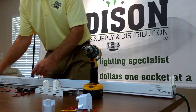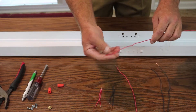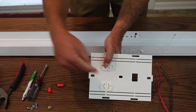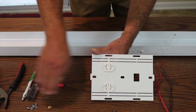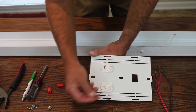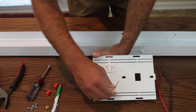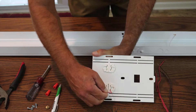Now let's go ahead and get to wiring up our centerpiece. For the sake of expediting the video, we've gone ahead and stripped down some wires here. You can scavenge these wires to cut down to put in the center of our retrofit piece. This piece in the center is what's going to be providing the power for the leg on each side of the four-foot sections of this fixture. We're simply going to cut down maybe a three or four inch length — these are just jumper wires. We have holes here and here, and we'll push this down so it catches, then loop it right back over and it will catch in there.